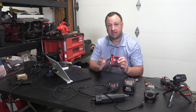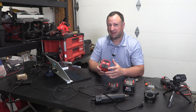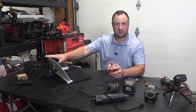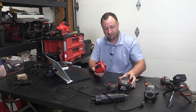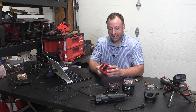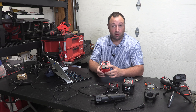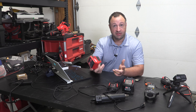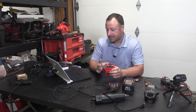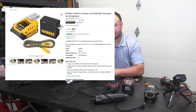Some of the pros of this is the fact that you have a 45-watt USB-C PD. It's a pro in the fact that it's barely enough to keep my computer running. If you're pairing it with a 12 amp-hour battery from Milwaukee, you get some decent runtime — like this will fully charge my laptop over the course of an afternoon. The fact that you have your AC 175 watts means I can take the OEM 130-watt power brick for this, plug it in, and then I get to charge at full speed. So that is kind of nice.